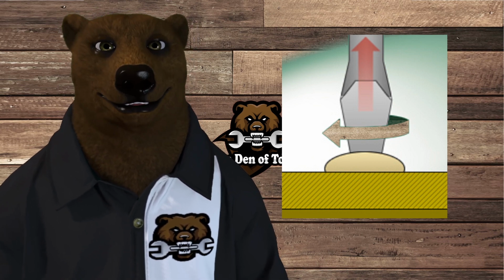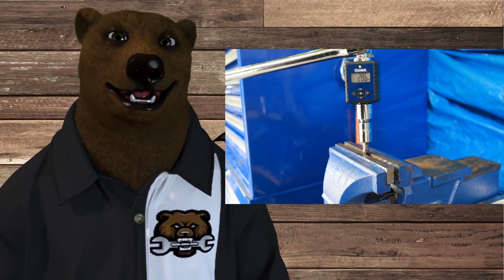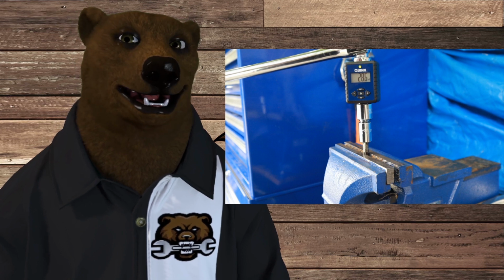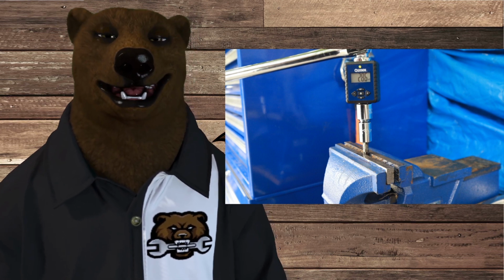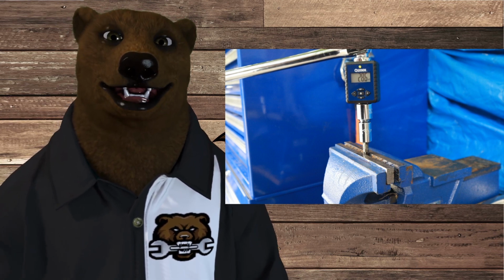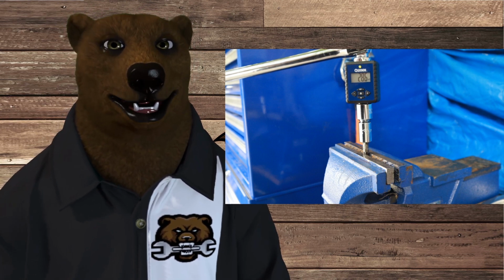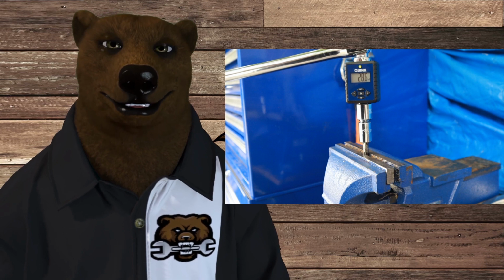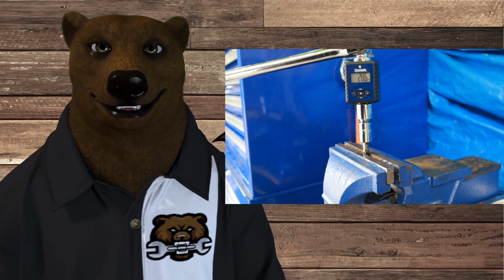There's too many variables. So moving on, we tried locking just the tip, just the engagement part, the blades of the Torx bit, if you will, into the vise to see if we could test torsion on the whole shaft of the tool. And again, this did not work out well. The vise ended up crunching the end of the bit and basically giving a non-effective test.